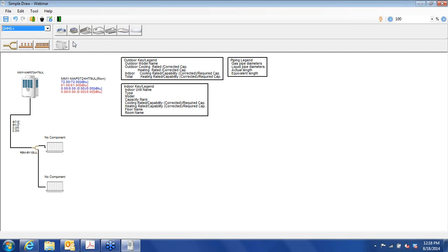These are the various indoor units that we talked about a little bit earlier. We have the ceiling cassette. That's the 3x3. It goes up to 3.5 tons. The compact goes up to 1 ton. The medium static goes up to 4 tons. High static is available in 3, 4, and 5 tons. Slim type, that is a low profile ducted unit that you can use in shallow ceiling cavities. The ceiling suspended, and then finally the high wall type.